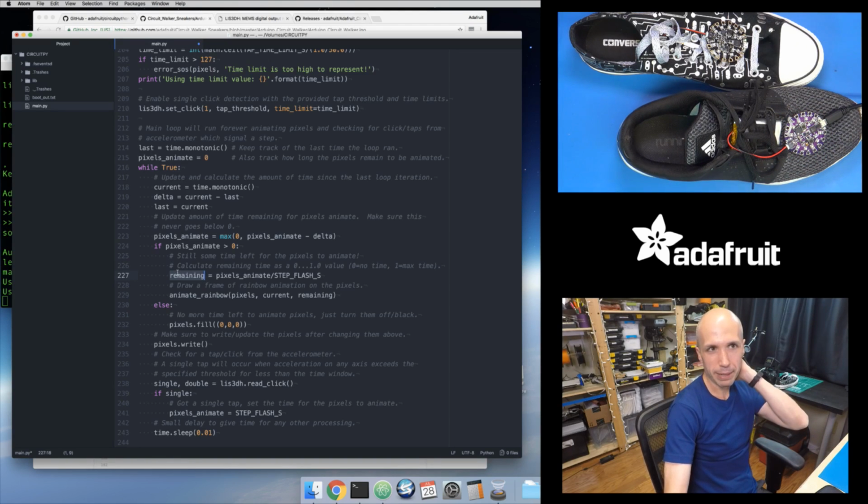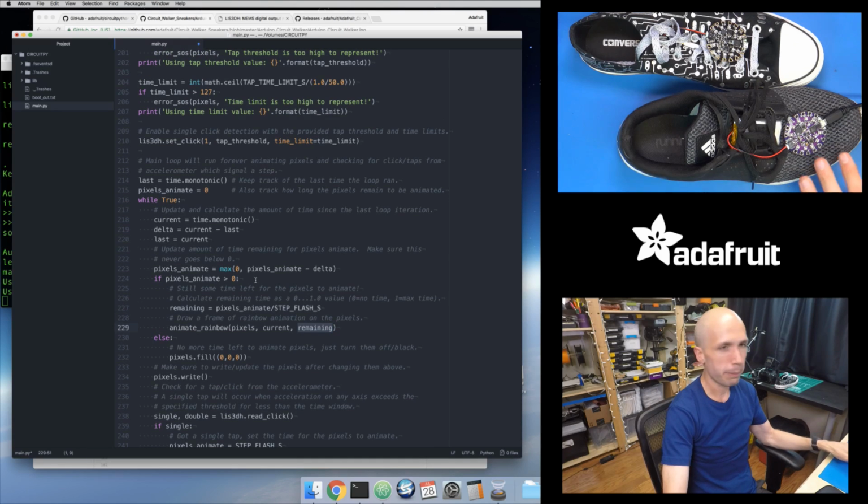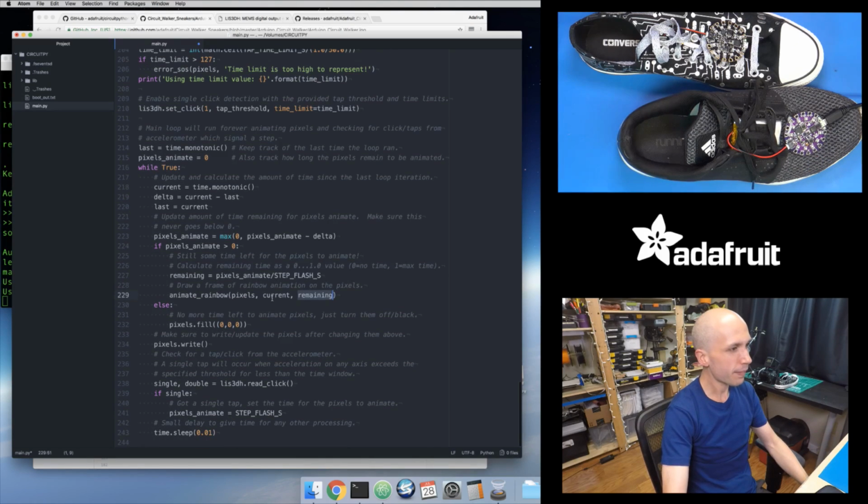It's nice how by using that HSV color space, I effectively get for free some of these neat little effects like that. I don't have to have all this logic in my animation that says, okay, some amount of time has elapsed, now decrease the brightness of my pixels. Because the color space I'm using intuitively has a notion of brightness, I can just animate that. I can just change that remaining value over time, and it will effectively animate the brightness of those pixels over time.